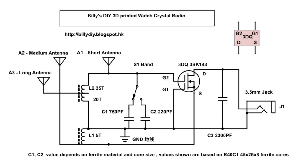Next let's look at the circuit diagram for the MOSFET. The MOSFET performs better than the diode for weak signal strength, but if you have a very strong signal the diode will perform better — meaning the output current will be much higher, and sometimes you can even drive a speaker with it. With the MOSFET you can still drive a speaker but at much lower volume, even with a very strong signal.